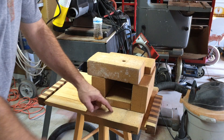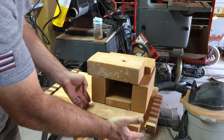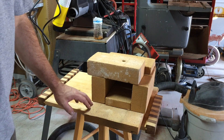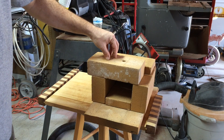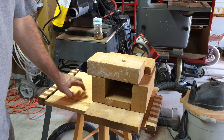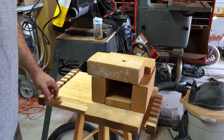Here I just added one of the four by nine by one inch bricks. I took it from the top where I don't really need it and put it down here as a little shelf, just to give it a little entry point so nothing hot drips down. If you notice I'm using a wood butcher block — these bricks resist heat so well I've never had any issues with the heat getting through to this wood at all. That being the case, if anything did happen I do have a fire extinguisher on hand.